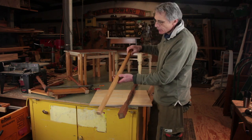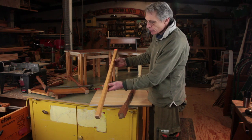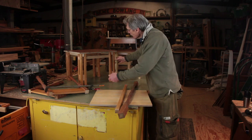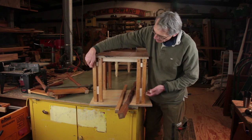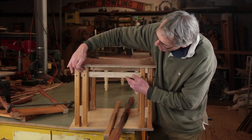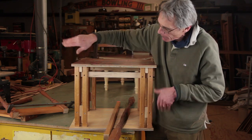Other stair spindles — banister staves — for instance these here made of oak, I treated the same way. I cut them in half and came up with a different possibility for legs. It's kind of like a cluster formation of three legs, but it allowed me to do the structural underpinning, meaning the structure that keeps the legs apart and keeps them from wiggling.